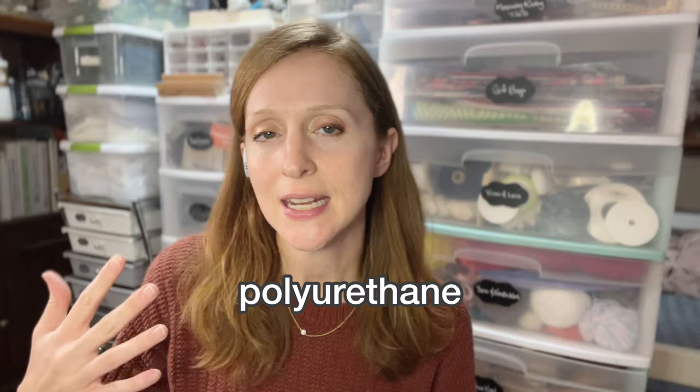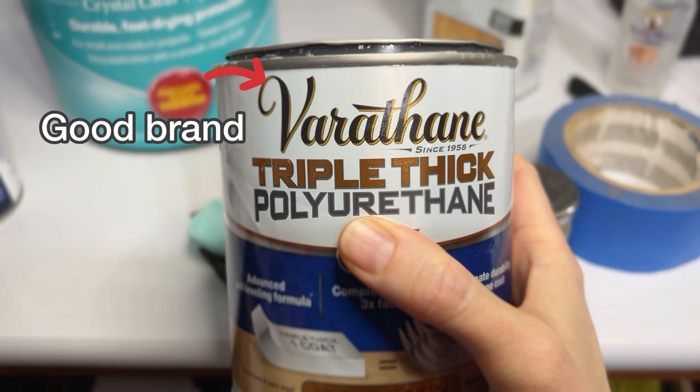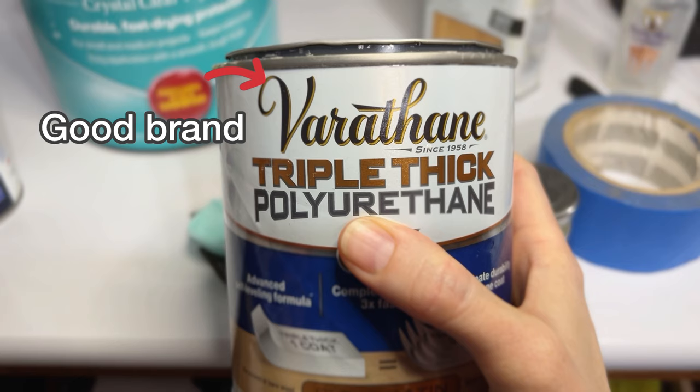Let's get into our finishes — a list of some of the favorites in the wood burning community. All of my favorite finishes are going to have links in the description to where you can get them, and in some cases I can get you a discount code. First: polyurethane. You can get it in liquid form or spray paint form. Polyurethane does yellow over time, but it makes a really nice hard surface — it kind of turns into a plastic. There's typically not a lot of UV protection with polyurethane, but it is a very popular option.